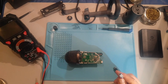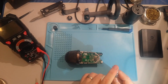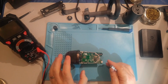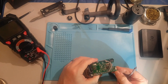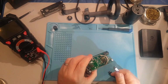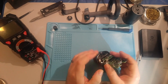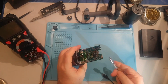All right. So actually I did a lot of testing and I found out that cables that are new and not worn work really well. Solid 100% performance. I'm not going to change this port at this time. I actually have one of these. I don't really like that it doesn't go through the board, and that you'd have to melt the glue around these other things. But the problem doesn't exist if the right cables are used, and I've got quite a few that work fine. This is a new one.